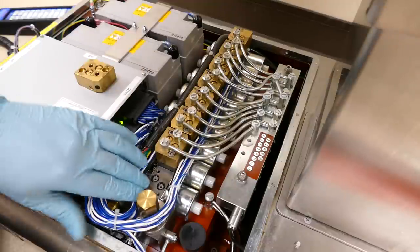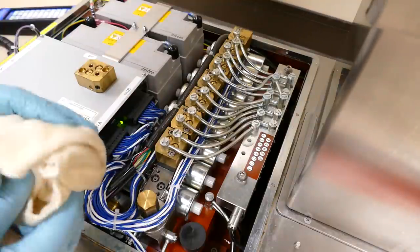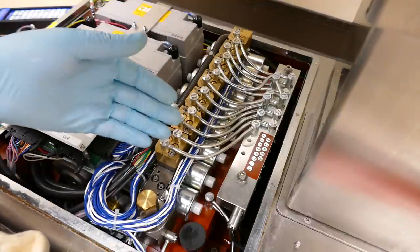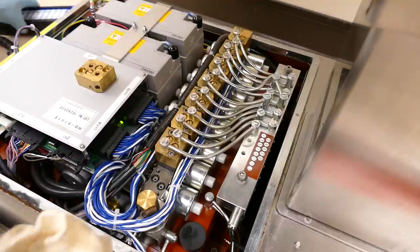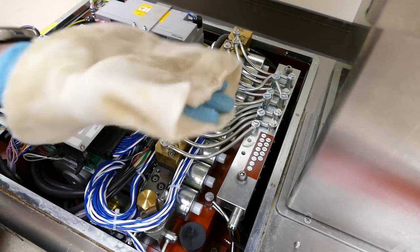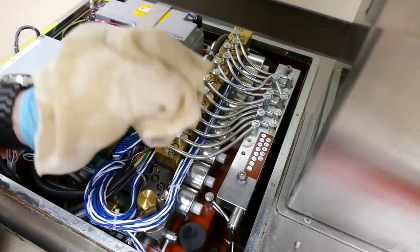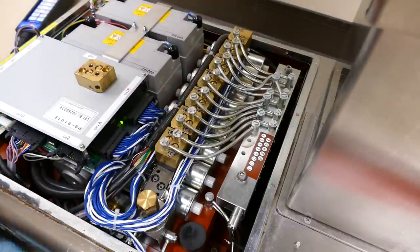I push the rag down in there to clean off as much hydraulic oil as possible. There are two other o-rings in the bottom block — leave those there. Now we're going to do a function check to make sure none of these passages are clogged, because if there's anything in here it'll clog up your needle valve and you'll be tearing this apart all over again. I'm going to cover this and put my hand inside the rag to show you how much pressure comes out — it will shoot all the way to the ceiling. I'll tap the slide head and then the slide foot — plenty of hydraulic pressure there.